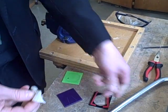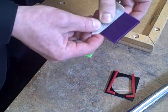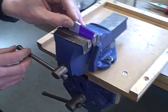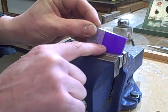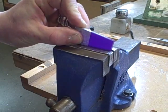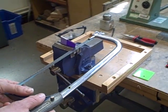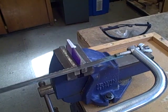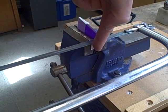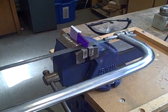I'm going to be using a piece of masking tape to mark out where the top of my lines is, because when I put it in the metalwork vise it's actually quite difficult to see. I'm going to position my piece of acrylic so that the engraved line is absolutely in line with the top of my metalwork vise. Then I'm going to use this straight edge as a guide for my hacksaw, holding it in a horizontal position and ensuring a nice 90 degree angle between the blade and the vise jaws. Then I'm going to cut back and forward until I get to my masking tape line.